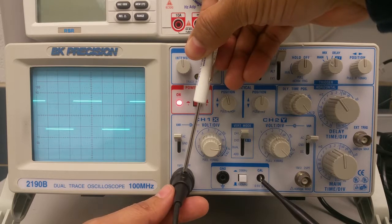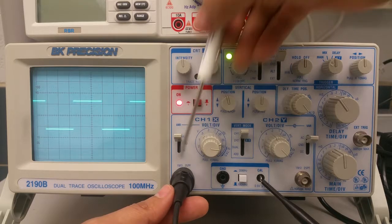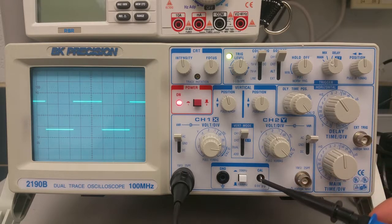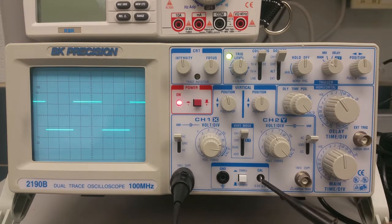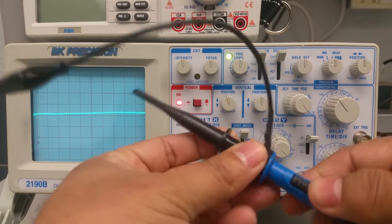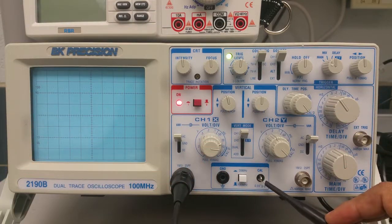All right. You want to calibrate your probes prior to making any measurements, or else you might get some error. Now let's look at the signal on the oscilloscope. Excuse me for taking so long to do this. When I want to check whether I'm actually getting 0.5 volts out of the oscilloscope, let's put this back to 1-to-1, meaning 1 volt in, I'm going to get 1 volt read on the probe. All right, I'll put that right in there.